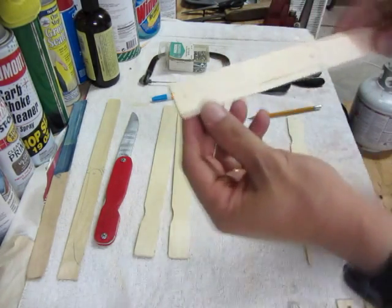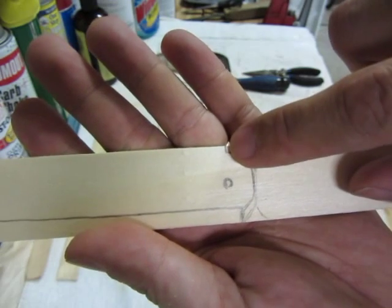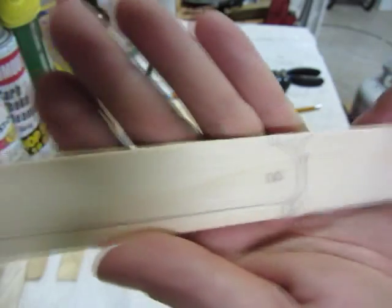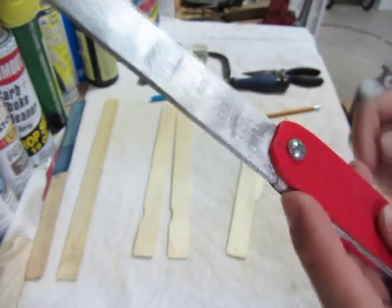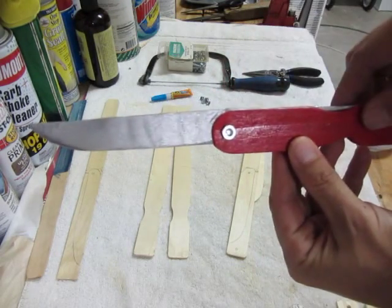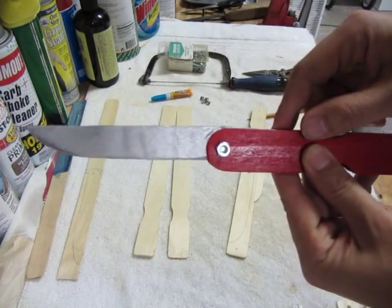Here's what it looks like. It's important to note the blade end: it's got a rounded top and a little notch for the catch. The notch on the lock back is a little longer than the notch for the blade — be mindful of that. If the lock back is too long the blade will cant forward, so you'll need to trim or file it down a little at a time until the blade is aligned with the rest of the knife.